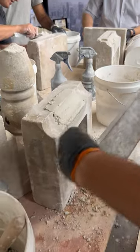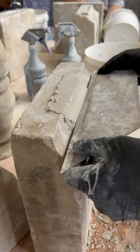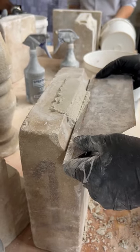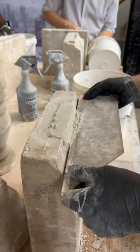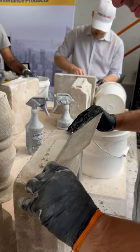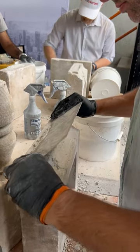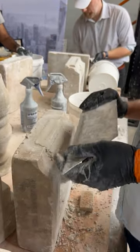Okay. And that's it. So now you have your eighth inch at the bottom, somewhat of an eighth inch in the middle. You can continue scraping. You can also take a little off the top as well by screeding back. This way? Yep. And then we'll check back in with you in a few when we're ready for our final screed.